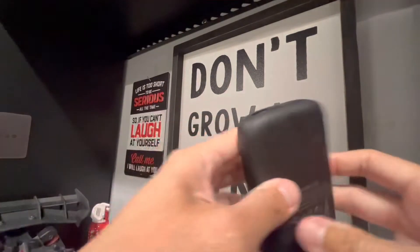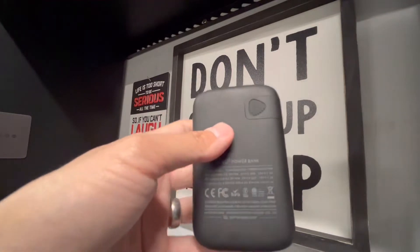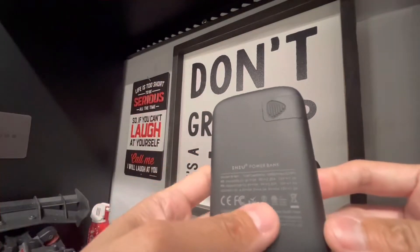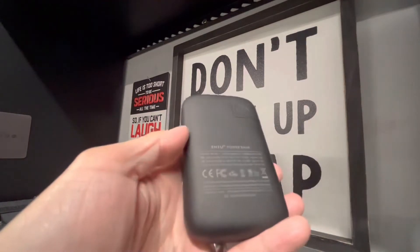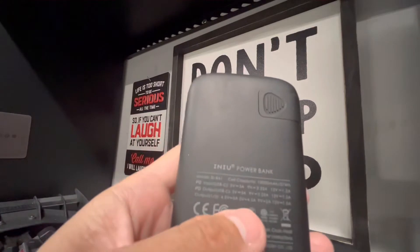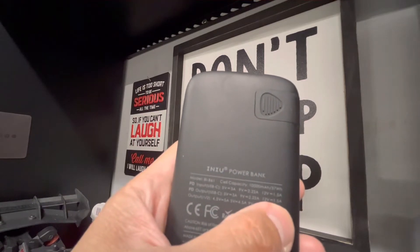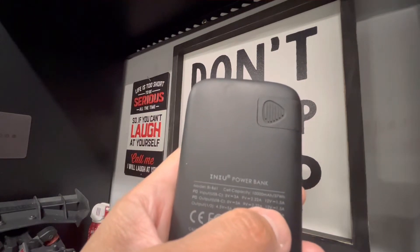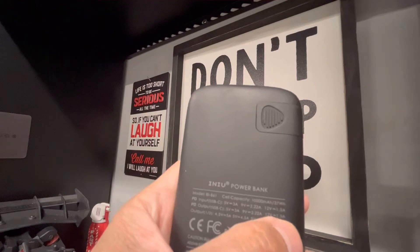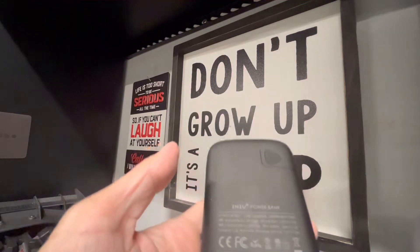You're going to make sure you get a battery bank that has PD — Power Delivery — capable charging. PD is not necessarily new technology, but people don't normally discuss it; they just buy a battery bank on Amazon. You're going to want one that has PD because it will have the voltage we need. This particular one is a 10,000 mAh bank with about 6,200 mAh usable. Looking at the PD output, at 12 volts we can use up to 1.5 amps. So if you're charging a 2,000 mAh battery, you will not be able to charge at 2 amps — this maxes out at 1.5. You can still charge a 3S battery with high milliamp hours; you just won't be charging at 1C.